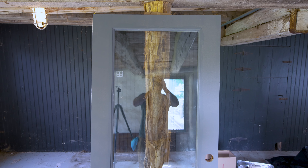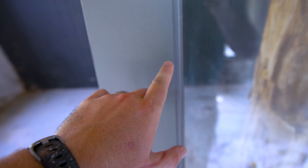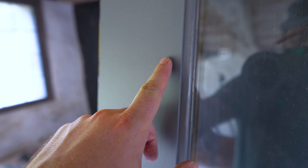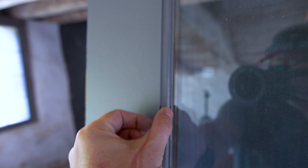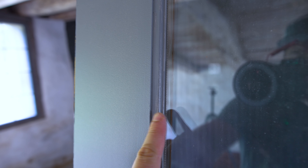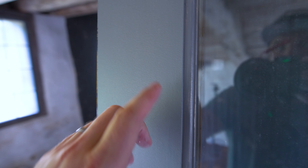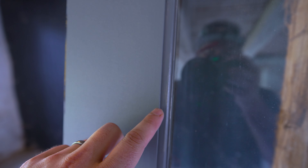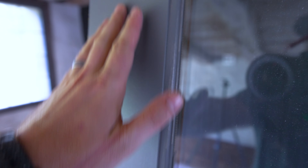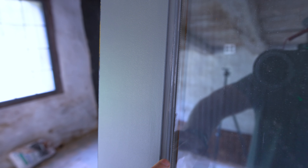Here is the door after one coat. The cut-ins around the glass are a little dark and a little heavy build right here. So when I cut in again, I'm going to stay super tight right in here and not get any on this piece. The roller is going to take three coats for sure, just because it lays it down really thin — which is fine. I like the stipple pattern on this, but I just need to cut a little tighter on these so it looks a bit better. I'm going to lightly sand a few spots here.